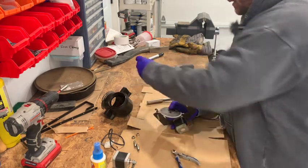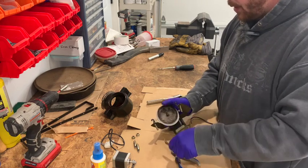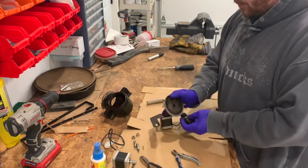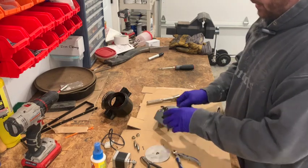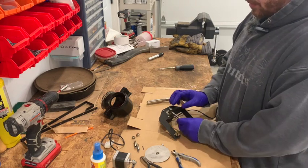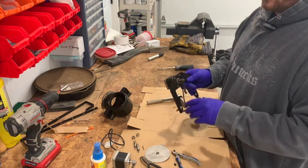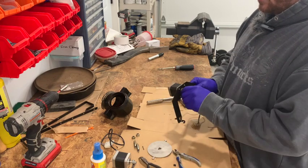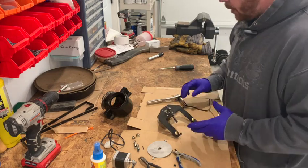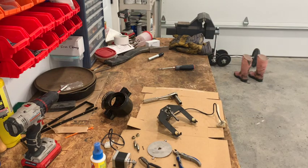It's not very dirty at all. I just had it apart a week ago and cleaned it all up, got all the creosote off. I thought that was the ticket — I thought I'd be good. But as it turns out, this thing started growling real bad. I've got mine set to every 18 minutes; it does an idle air pulse, and the secondary dampers do their thing — they flutter to make sure they're free. You can hear the stepper motors, and this one is distinctively deeper with a pretty nasty growl to it, so I'm assuming maybe there's a bad bearing in there or something.